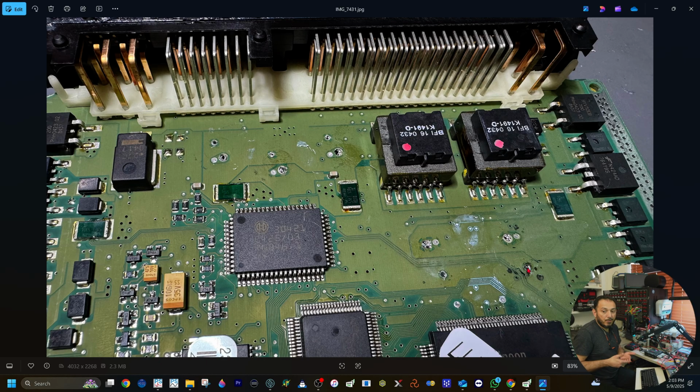In the upper layer it is not such a big problem, but internally, this board has 6 different layers, with reference and communication lines that go under it, because you can see what the manufacturer did in here. They put the main lines on the top, and there is a layer of power and another layer of ground that runs across the entire board. And when that acid gets in there, it melts it together, and then it's impossible to fix that short, and it's garbage. I have tried, believe me, and it was just a waste of time, and that doesn't work.